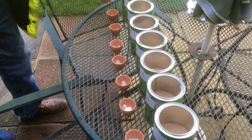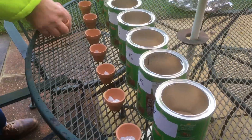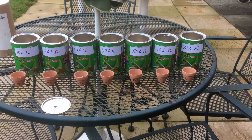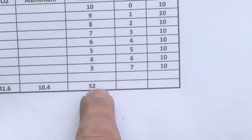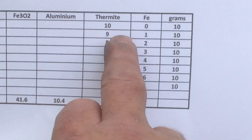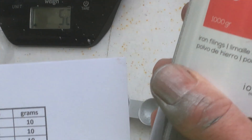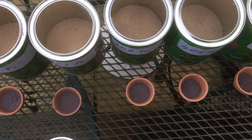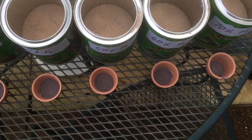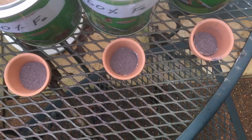I was very optimistic about how much I could add. I prepared small tests of 10 grams each, ranging from 0% to 70% iron granules in 10% intervals. I mixed up 52 grams of thermite first and then added the iron to each test — in total 28 grams of iron. The 8 small pots are collectively test 3: the search for the optimum yield. Small clay pots with tin foil covering the hole in the base were used to drop molten iron into a tin of sand, so that the iron could be recovered and weighed.